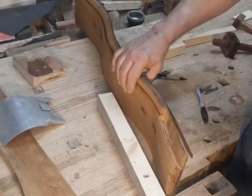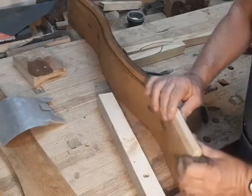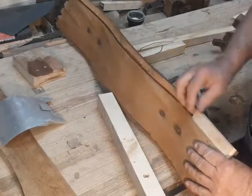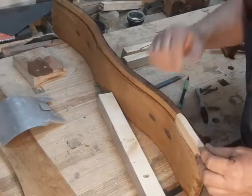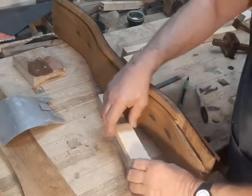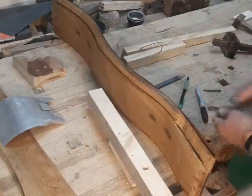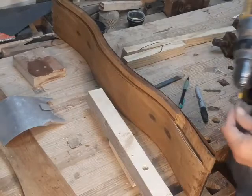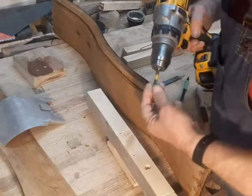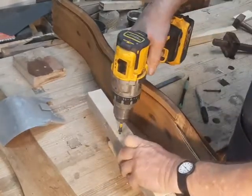With a little artistic work at the belt sander, that looks like it's going to fit pretty good — except for the problem with this groove right here. Cutting that kind of groove in such a small piece is a pretty dicey operation. So what I'm going to do is fasten it to a bigger piece of wood so I can take it over to the router table and hope that I just get that groove right through in one pass and don't take any fingernails with it.